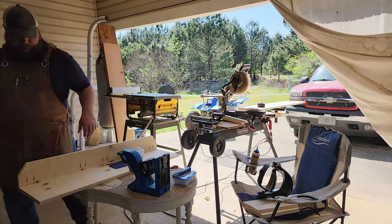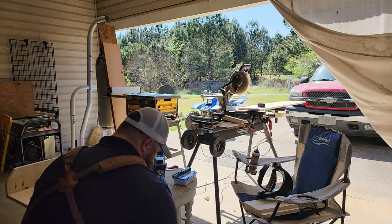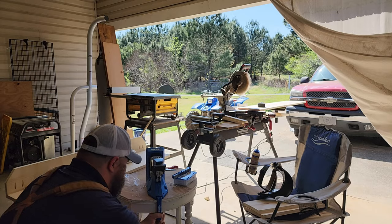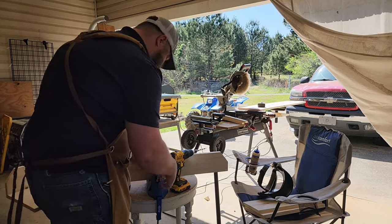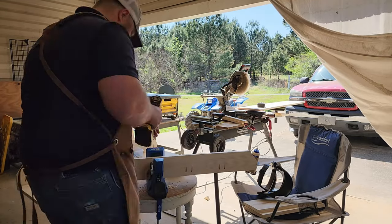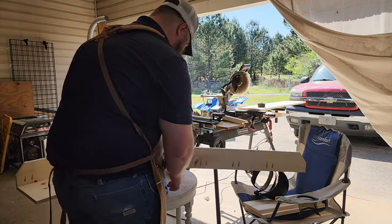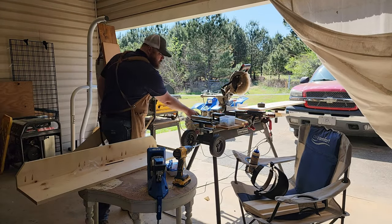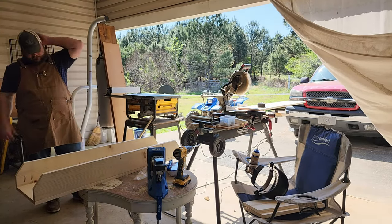See how easy that is — once you put your pocket holes in, it's just driving your screws in and making sure you line up your edges so it's flush. You could sand it down to flush, but that's a lot of sanding you don't want to do. I decided to clamp my Kreg down because it was moving, which was a pain. I go ahead and do the other board the same way. Generally I will glue everything as well, but I did not because this is a prototype bench — when I'm first building something like this, I need to be able to take it back apart quickly if I don't like it.